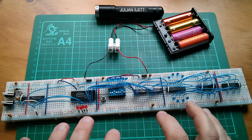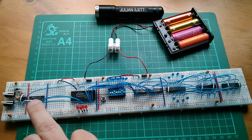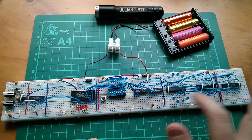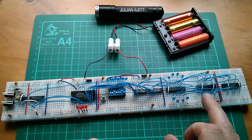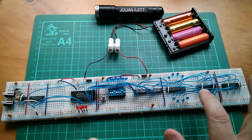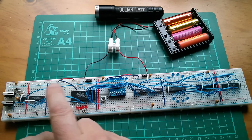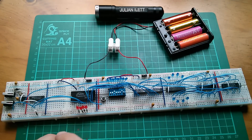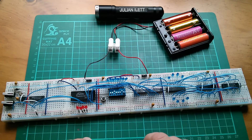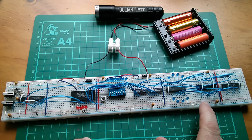It probably isn't Turing complete because you can't, at the moment, write to the program counter. So what I was thinking of doing is implementing a program counter over here as a peripheral connected to the data bus. You can write to it so that you can do unconditional jumps — write a completely new address location. The output of that latch would be fed back to the address lines of the RAM so that you can jump around within the RAM's addresses at will. I also want a little bit of hardware where the program counter can just increment, and I thought of doing that as a simple add-one — a very crude adder which just adds one.